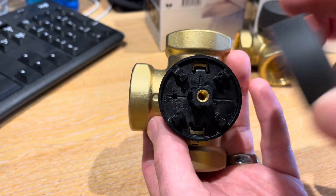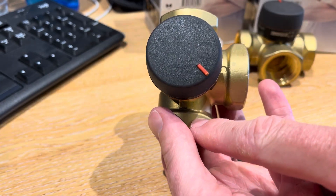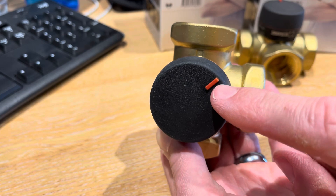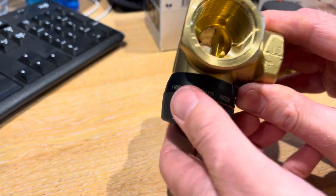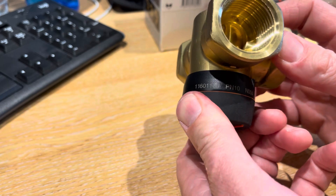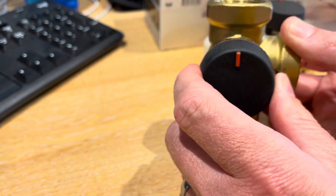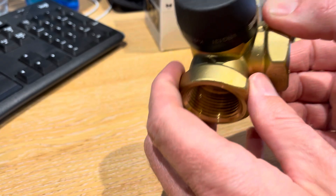If we were to flip this round so our input was on the triangle and then go out the side circle and square, we would need to turn it up to the 45 position, which would then mean that our shoe is in the right position to actuate between the top and the side. Inside these valves there's an L-shaped shoe. The L-shaped shoe decides where the fluid is going to go. If I move that from the 45 position over to the top position — moving from there to here, up to the square — you'll see now that the square port is now closed.